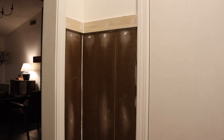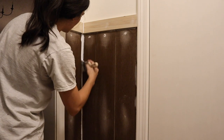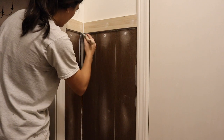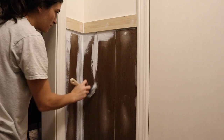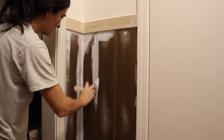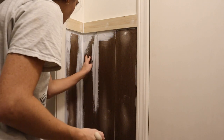After I filled in all the nail holes and caulked around the edges, it was time to start priming. I'm using Zinsser 1-2-3 primer on these boards because they are very absorbent and slick, and this primer sticks to it really well to make a good surface for the paint. I started with a brush to paint inside the gaps between the boards — time consuming but it gave a really finished look — then rolled the rest, doing two coats total.